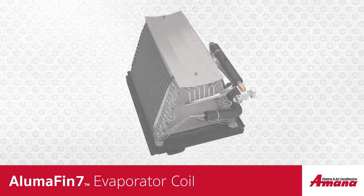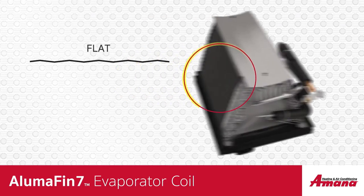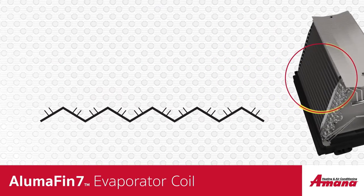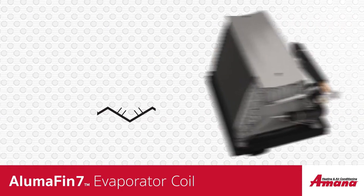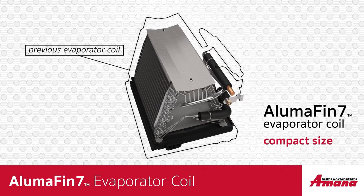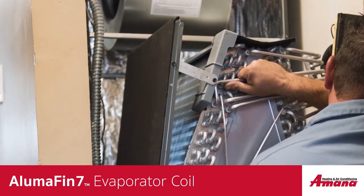And speaking of surface area, the fins on an Alumafin7 evaporator coil are not flat, they're multi-louvered. Look closely. These louvers help to create more opportunities for the warm, humid air to lose water vapor. Another benefit of the small-size tubing and multi-louvered fins relates to the physical size of the Alumafin7 evaporator coil. The smaller tubing and the multi-louvered fins allow the evaporator coil to be smaller in total size without a loss of performance. That can be really important if your local HVAC dealer needs to install the coil in a tight space.